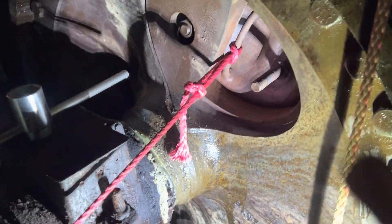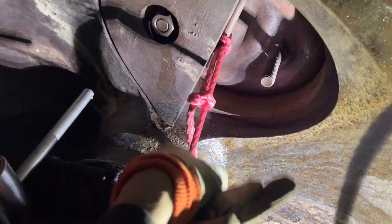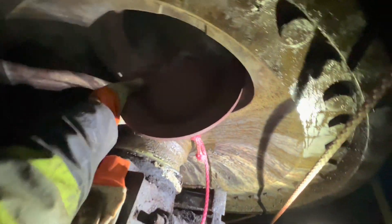Use a crank bar to break this off because these are cranked on tight. Do yourself a favor — I put a couple marks here so you don't get these caps all mixed up, because there's a certain way they have to go and you've got to be careful. So I put a couple marks there before we take it off. Okay, so I pushed it in there and then pulled it out — here we go.